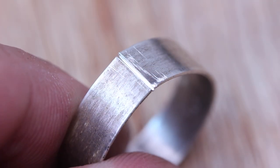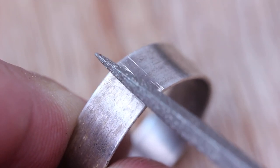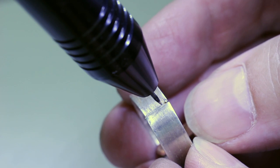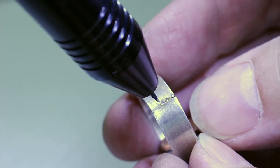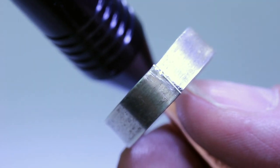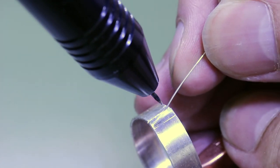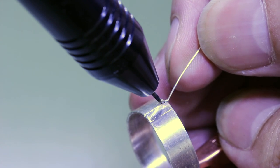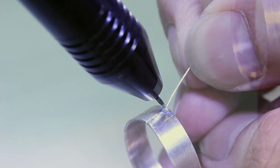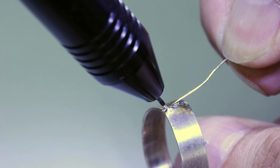But what do we do when the metal is too thick to penetrate even on the higher setting? Well, this is a more advanced technique — the method is to file a V-shaped groove along the joint using a square or triangular file. We can start with just a couple of light spots to hold the piece together and then go along the bottom of the groove to create a weld. For the second pass we can add some material by taking a thin piece of sterling silver wire. Hold the wire at 45 degrees just touching the metal and weld the two at the same time. When you hit it, a little spot of the wire will melt into the gap — continue with just a few hits to fill the groove.